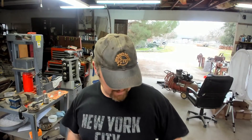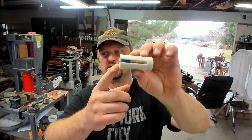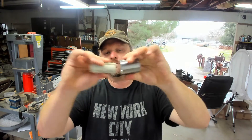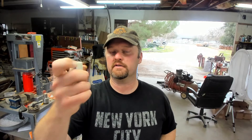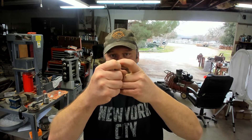Hey guys, Jason here with Jason's Works. Just wanted to get a video out regarding the new pro tip — we have a new insert on these Ross pushers. The idea is that when you're pressing your Ross pusher into your swage die, that inner support is going to make the legs more rigid, so they're less likely to slip inside the coin and possibly chip the very edge. I have another video showing how to repair that if it does happen — quite easy, really. Skyler came up with that idea and I'll put a link to that video around here.